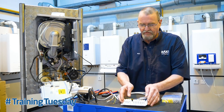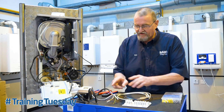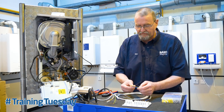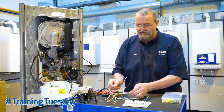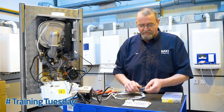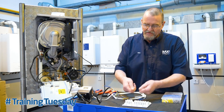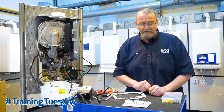So we've got a scenario where we've got a Honeywell wiring centre and we need to get four neutral wires in. We've got various sizes of cable — a couple of 0.75mm, one off the motorised valve, and a two core cable. We need to get all those neutrals in, but jamming them all in sometimes doesn't give us a good connection.